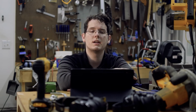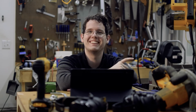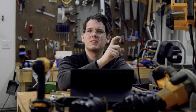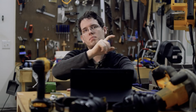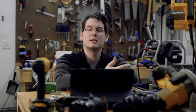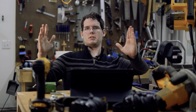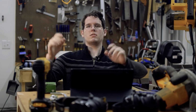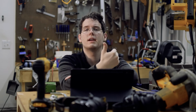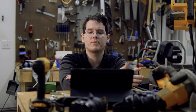Some tips on applying the leak seal. You're going to want to maintain short controlled bursts, spraying in about 1 second increments. So like psst, psst, psst, just like that. And you're going to want to maintain the proper distance, which is around 14 inches from the prop. Spray that on, and while you're spraying it, you want to do one light coat followed by one heavy coat. It's something you just have to get a feel for.